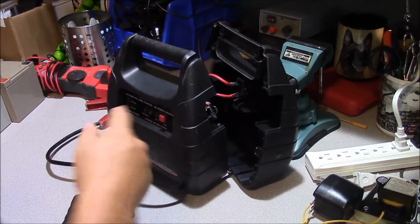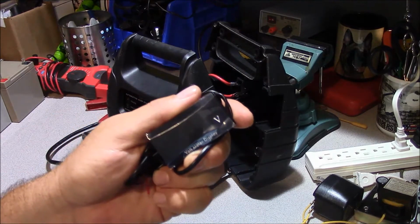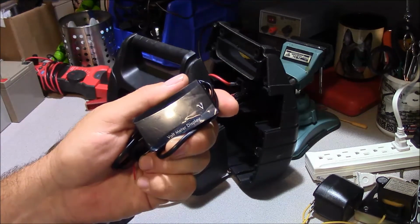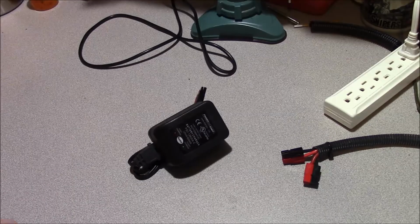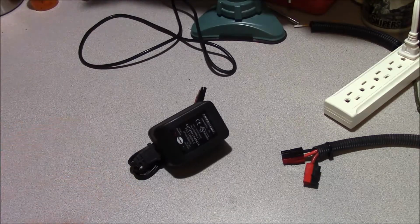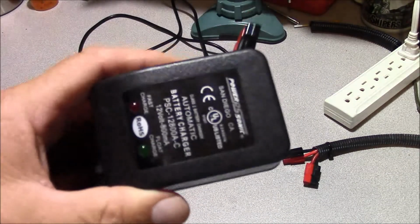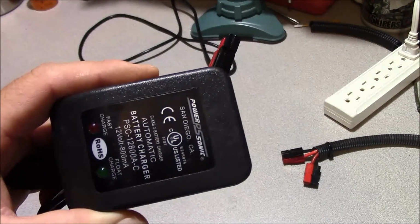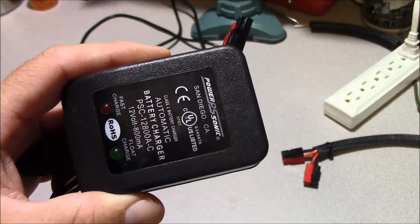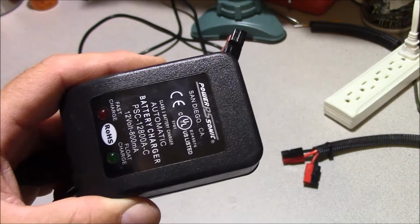But instead of having that, I'll just discard the charger, and for 11 bucks I got one of these digital voltmeters, and I'm just going to go ahead and affix it on top of here. Considering the original charger internal to the booster pack is shot, I'm just going to use one of these right here and basically put some power poles and attach those to the booster pack, and those will also double as an additional output that's similarly equipped in the booster pack itself.